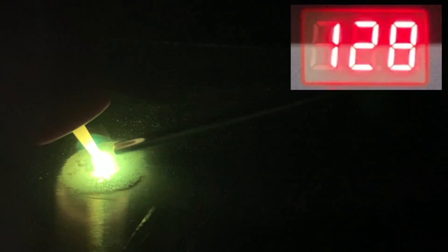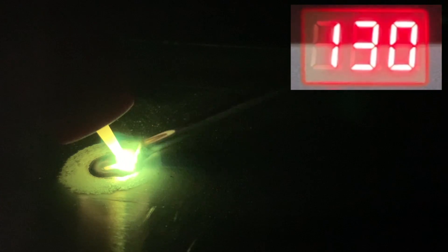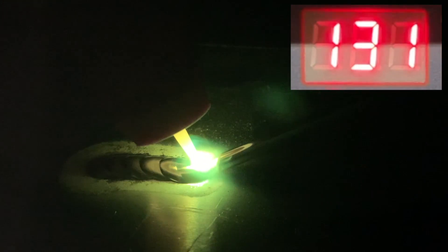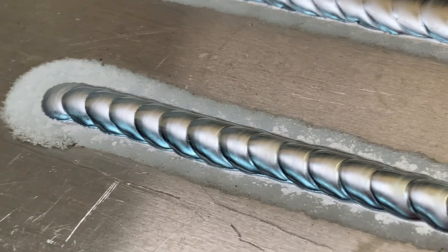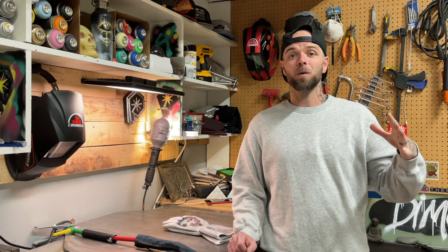Take a look at this weld here. You can see in the corner there's an amperage display. As I'm buzzing along laying filler rod down, you can see that my heat is not fully blending the filler rod into the base plate. I could slow down at the start to allow for a full blend, but without enough amperage set on the machine we can hang out all day — we can switch to a thinner rod, it's not going to matter. In this case it's much better just to turn up the heat to an adequate amperage level and get going from there.